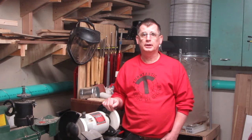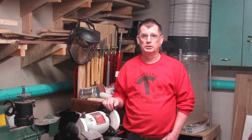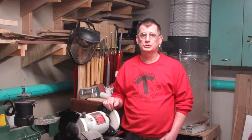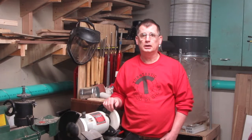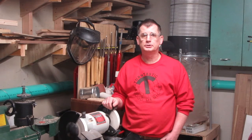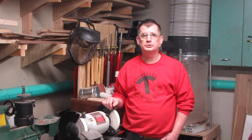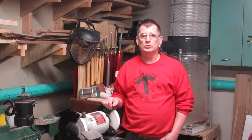When doing wood turning, sharp tools are essential. If your tools aren't sharp, it's impossible to get a smooth surface on your wood, and it can be dangerous. When you think about it, the wood's turning at sometimes up to 3,000 rotations per minute, and all that material you take away, you're actually carving out miles of wood. So you have to know how to sharpen your tools.